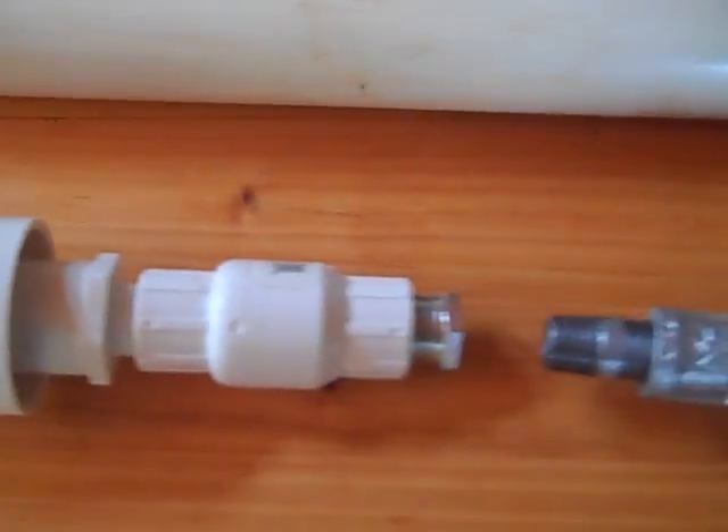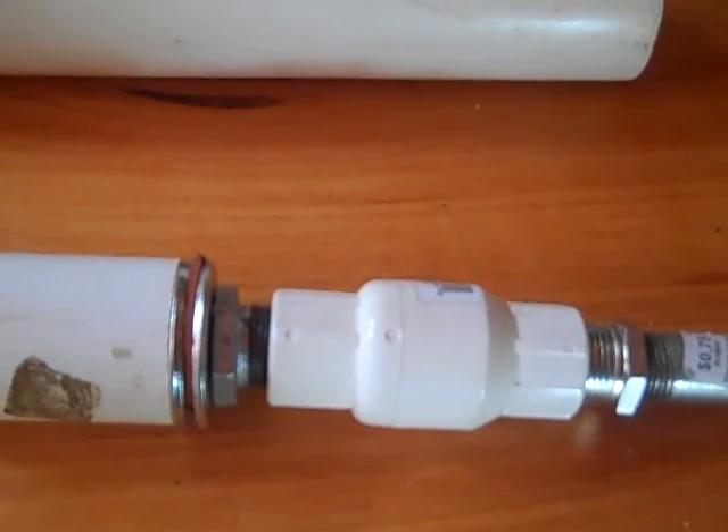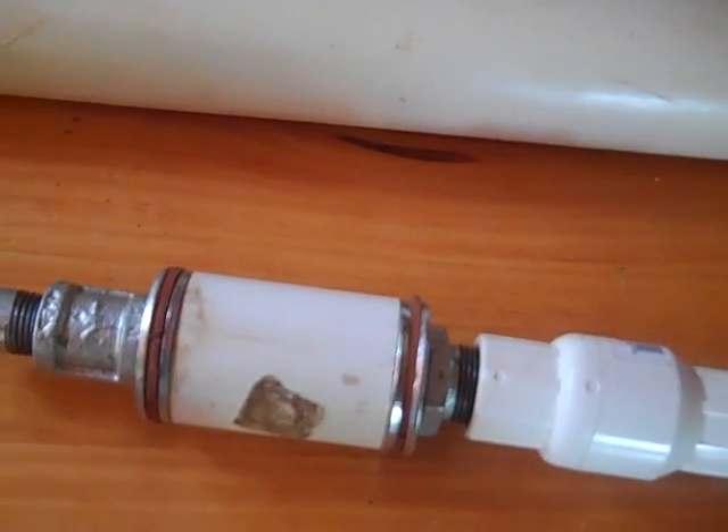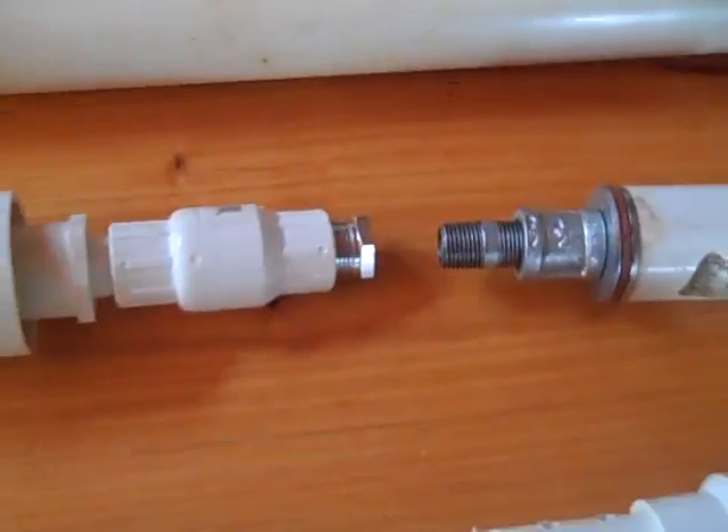The main thing is these three-quarter inch check valves — instead of one-inch brass at the bottom and three-quarter at the top, I just replaced them with two three-quarter inch PVC check valves. They are a quarter of the cost of the brass.